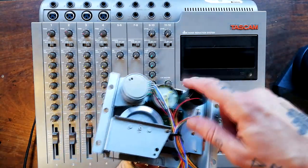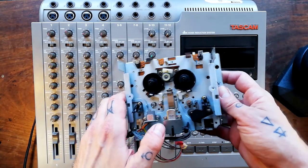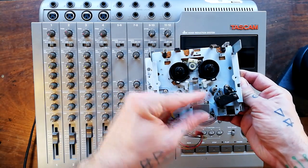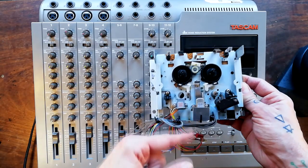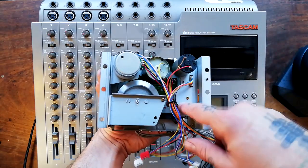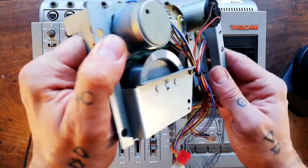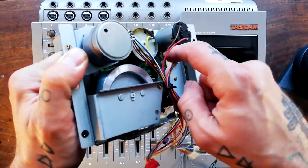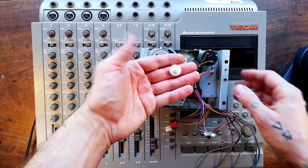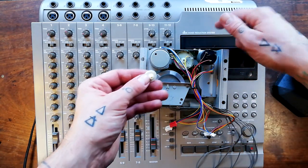And then the final motor — that's changing your mode in response to the shuttle button, so it's deciding whether this pair of heads is retracted or pressed up against the pinch roller up against the capstan, the tape heads up against the tape. And the way that motor transmits its motion to this mechanism — basically there's a series of gears in there. And for whatever reason, Tascam sent away Gear C, which is the one near the top, to be made at a different factory.